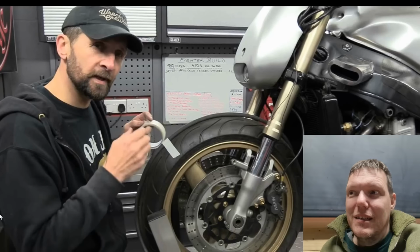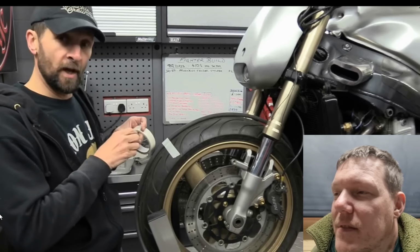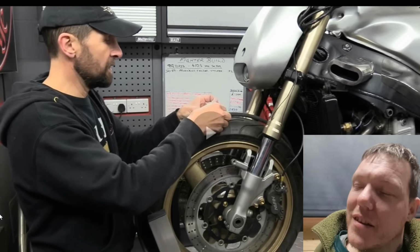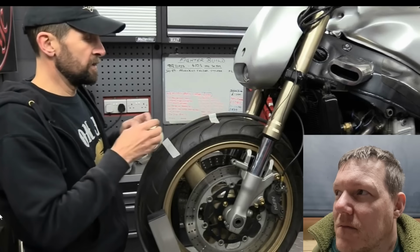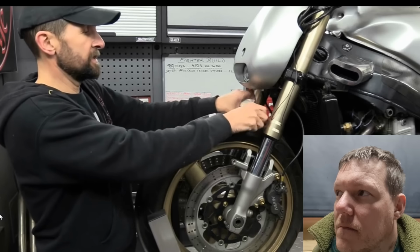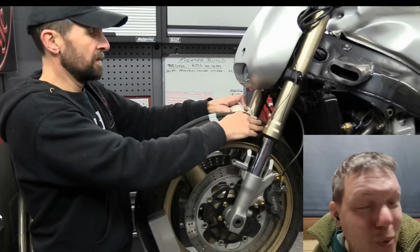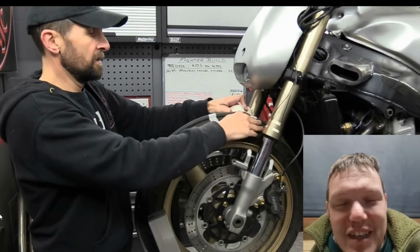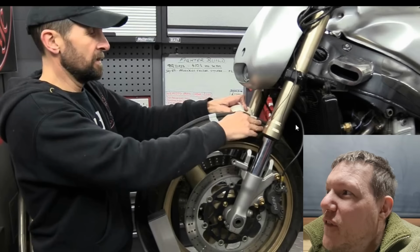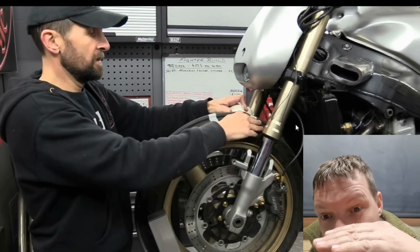And then you put it on top of that. Not one. Because obviously what you have to consider is stones getting underneath there. Because on one, it'll just rock. That mudguard is too close to the tyre. Then if a stone gets up underneath, your tyre will grab it and either fire it straight into the bottom of your bike, or fire it up, or fire it out at a pedestrian. That pedestrian that you're about to cut in half with your really sharp mudguard.